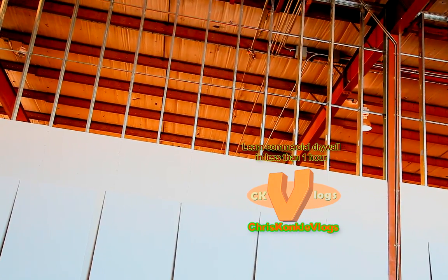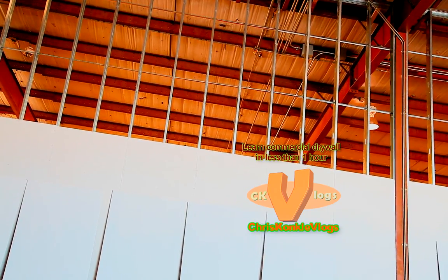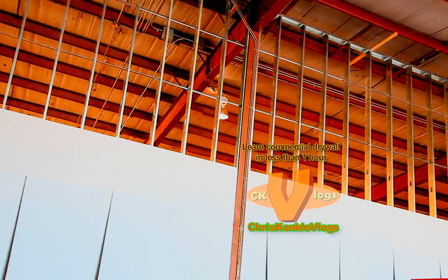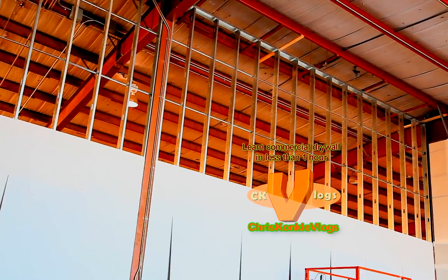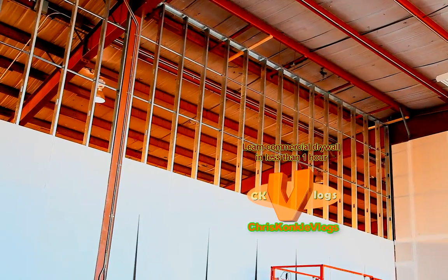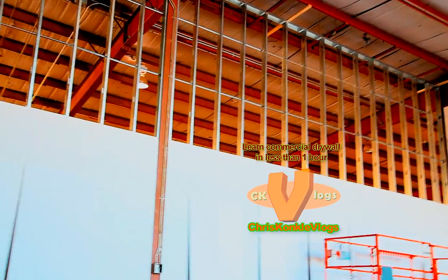Another very important thing to note is, again, just like the wall, I don't start in the ends. I don't start where my cuts are. I start somewhere inside the wall, generally the first full sheet in. Especially with these 10 foots, there's nothing in the way. There's no cutouts, it's all gravy, so just start in the first full sheet you got, and then you do come back to do your cut-ins after so that you can take your measurements properly. Okay, it's very important.